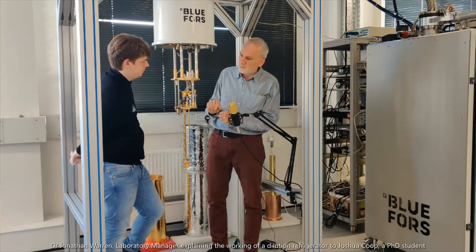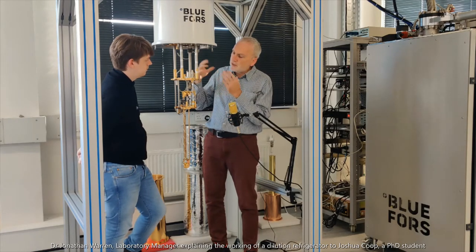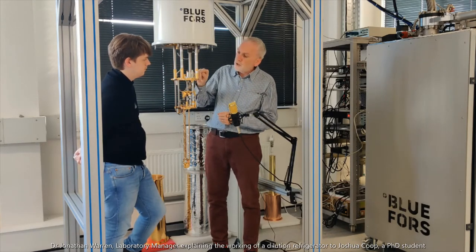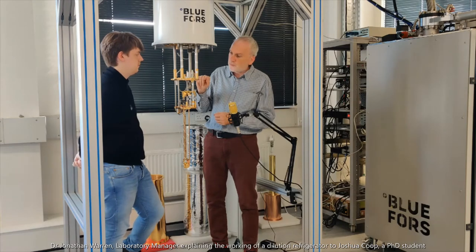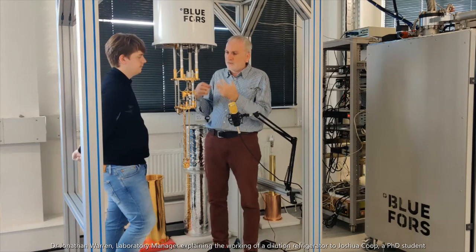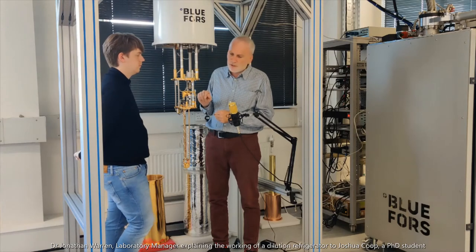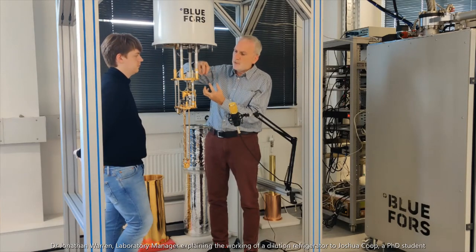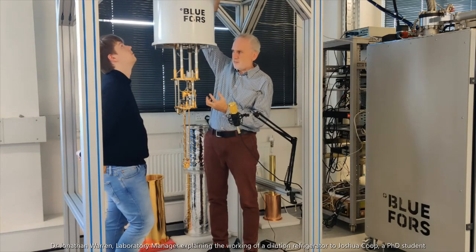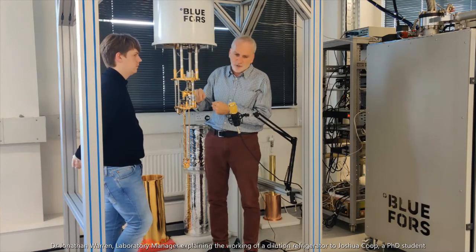This bit of kit exists to enable us to continually dissolve atoms of helium-3 in helium-4. That happens in this little chamber here. This little chamber up here is called the still — very analogous to how you would distill anything else, like making gin. We have a mixture in here of helium-3 and helium-4. Because the helium-3 has a higher vapor pressure, it evaporates more easily than the helium-4. If we pump really hard on here, we can pull the helium-3 out of the helium-4 using a giant pump right up there, and another set of pumps returns it back in again so we can dissolve it once more in the helium-4.